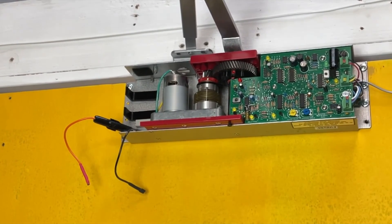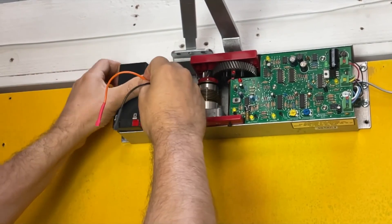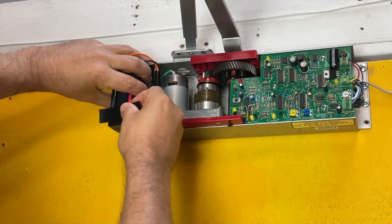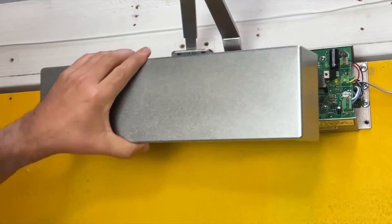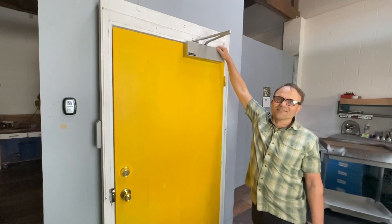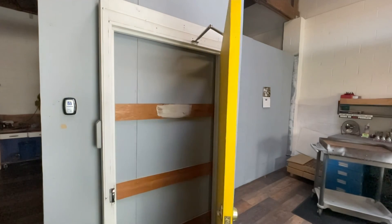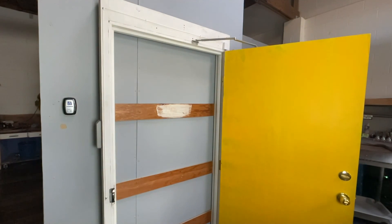To replace the battery, use a new 12 volt 1.2 amp hour battery. Pop a little electrical tape over it and close up the cover. Make sure your ladder is out of the way and test the unit. You can use your remote or the test button. Note that if the battery is not fully charged, it may take a couple of hours for it to become fully charged.